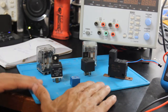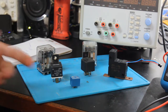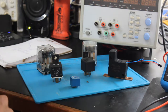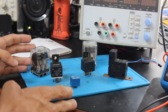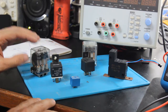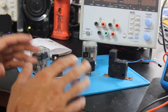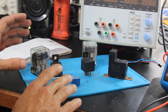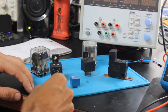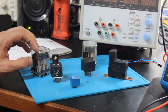We're going to focus on mechanical relays in this video because that's what I use in a DC reversing relay circuit. The basic job of a relay is to take a signal — an on or off signal, with no in-between — and use that signal to activate a secondary set of contacts on another circuit.